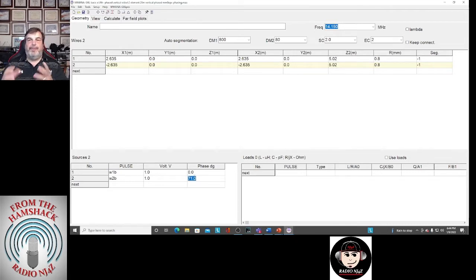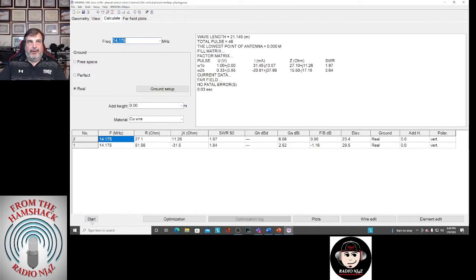He shows you the build on the box and everything. Pretty neat antenna. Instead of using 71 degrees, he was doing longer phase lines for the feeders. Instead of 84 degrees, he was using 156 degrees. And he was using 39 degrees as his phasing angle, which I thought was really interesting because that's quite a small angle. But it turns out to be really quite good.